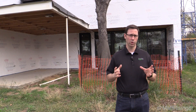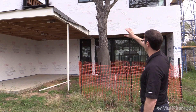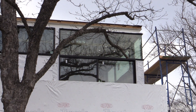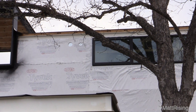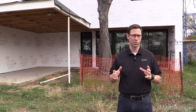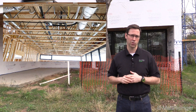If you look behind me, this house has some western windows and doors that go nearly up to the roof line. Look at that one up there. The steel beam that comes across is basically about eight inches deep or so, and that window comes right up to the steel beam. It's going to be a really interesting house, and the only way that was really able to be pulled off was because we used a special type of truss called red-built trusses.